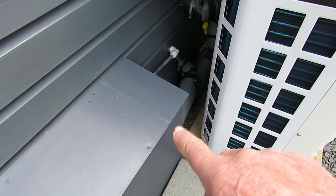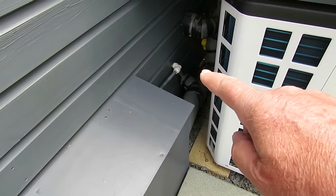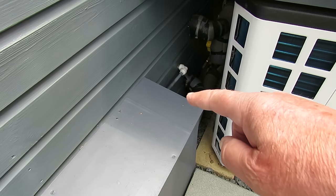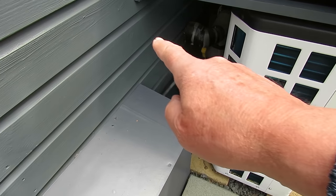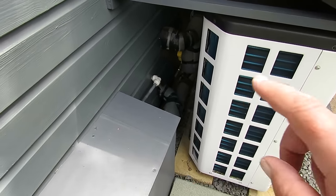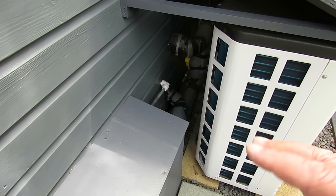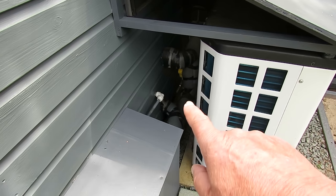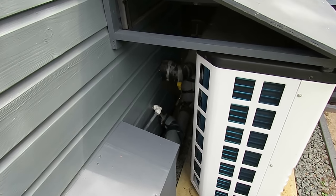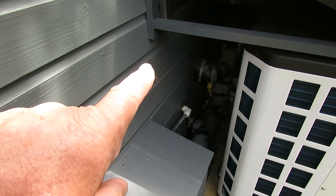Along the bottom, the pipe goes along and branches off so that there is a bypass - I can have it flowing round and through the heater, or I can have it flowing straight back into the filter house without going through the heater. The majority of the water goes through the heater; the excess water that makes too much flow passes through the bypass. So it's getting about two thirds through the heater and one third through the bypass, and from there this pipe here is where it goes into the actual filter house.